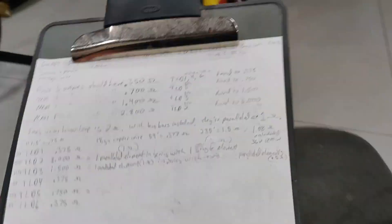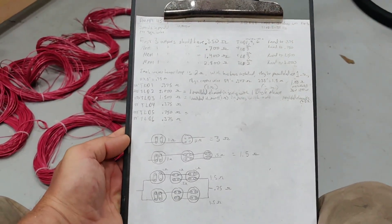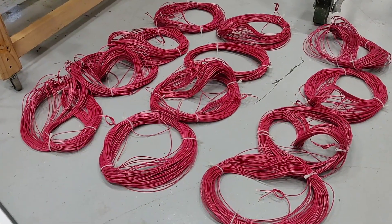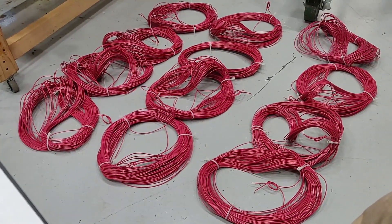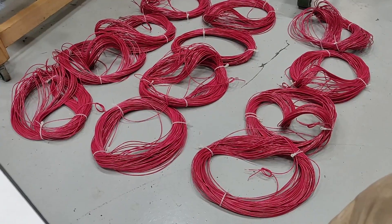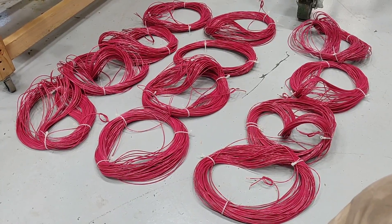I did a little bit of math on this. Here's my notes — that's pretty much how I'm going to have to wire things up to get the correct amount of resistance. Each loop will be dissipating approximately 500 watts when I have all the elements hooked up properly. At full sun, I'm going to use the same amount Dacian recommends — 39 panels — but I do have 40, maybe 41 available. I don't know if I can add those extra two or not.